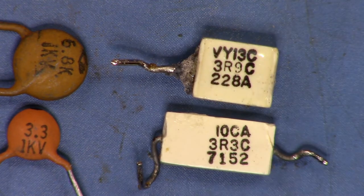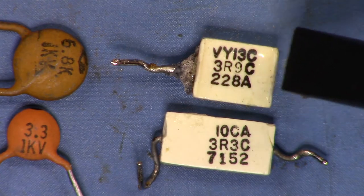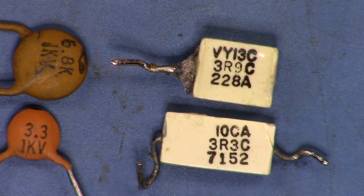What they have is two capacitors — this 3.9 and this 3.3 picofarad capacitor — in parallel. They're probably doing one of two things: either trying to get a slightly wider impedance band, because this first part is the attenuator that takes the signal in and attenuates the value before it passes off to the input amplifier — I think I incorrectly referred to it as a filter — or these things had some higher ESR and by putting them in parallel they're trying to decrease the ESR.